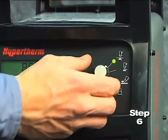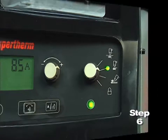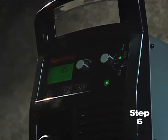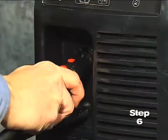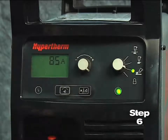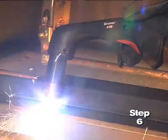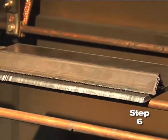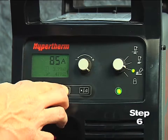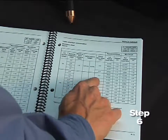Sixth, set the mode switch to the second setting for plate cutting. The PowerMax 65 and 85 models are designed to sense the incoming air pressure, torch type, torch lead length, and mode of operation, and then automatically adjust the air pressure. This feature, which we refer to as SmartSense technology, ensures that the system is getting optimal air flow, which will result in better cut quality and prolong consumable part life. If you want to manually adjust the air pressure for a particular application and not use the default feature, please refer to the operator manual for more information.